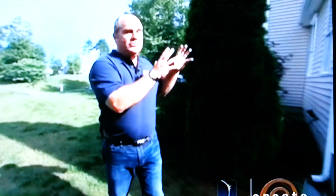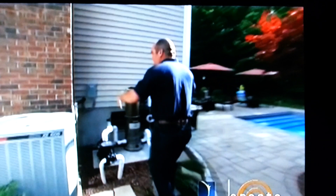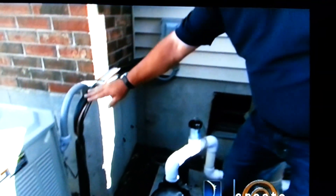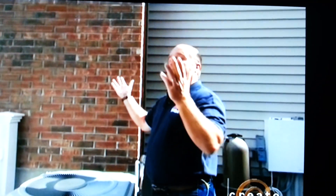Air conditioning makes cool air — it actually removes heat from inside the building, leaving cool air. That's done through the basic refrigeration cycle. There's an inside unit that captures the heat and transfers it into lines filled with refrigerant. The energy goes through into a condenser, and a fan pushes that heat up and away to the atmosphere. In this case, heat is energy that is wasted. Today we're going to find a creative way to put that energy to better use.